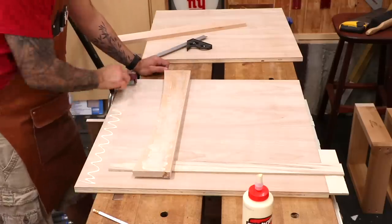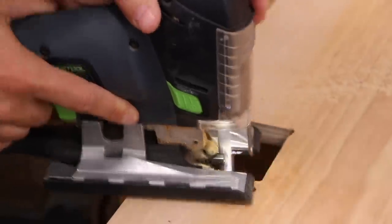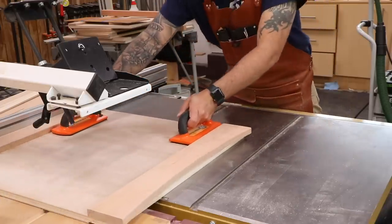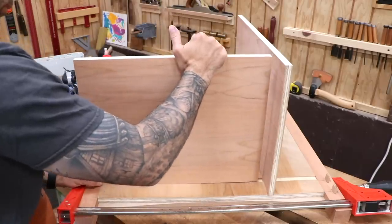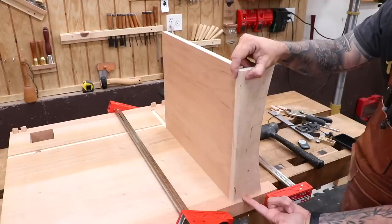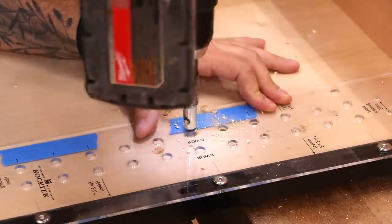The panels of the desk are essentially faux frame and panel, so the rails are just face-glued in place. To accommodate a wire gutter, we need cutouts into two inside panels. The right pedestal receives a back and bottom. The back creates an open space for cables and power, and the bottom panel is spaced about an inch from the back panel to allow for additional airflow. The bottom panel is then attached to the bottom rail. Now we can cut a few holes for power, wire grommets, and a ventilation fan. Using a jig, I can drill holes for adjustable shelves.